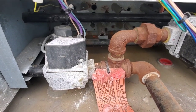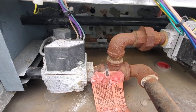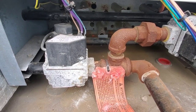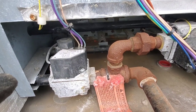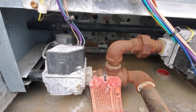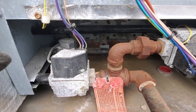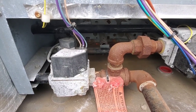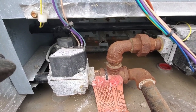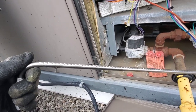Here's the burner. The bottom one is the second stage, the top one is the first stage. The bottom one's not being used at all — fully disconnected, gas is off the gas valve, and it's disabled electrically. The top one, when it goes to light the pilot, it's not being distributed evenly across the runner tube, so the flame sensor is not picking up and it's not going to main flame. We're going to replace the pilot tube right here.